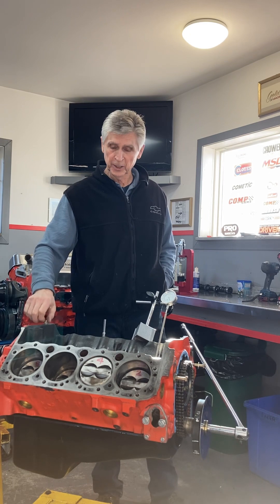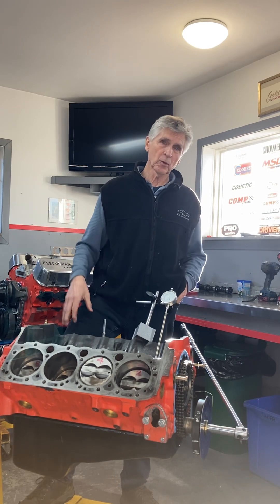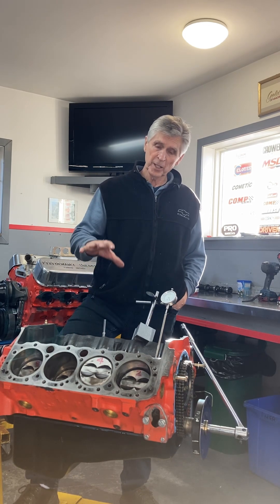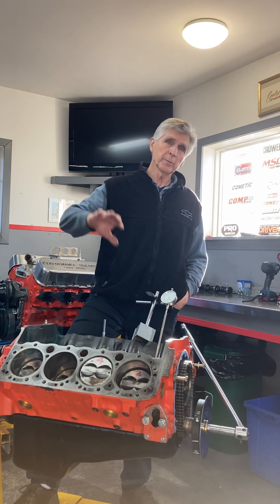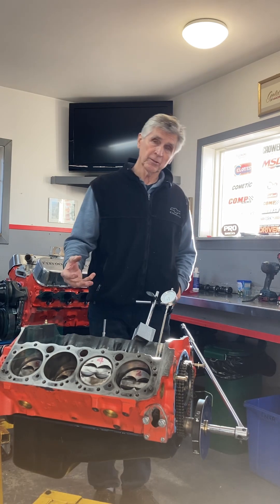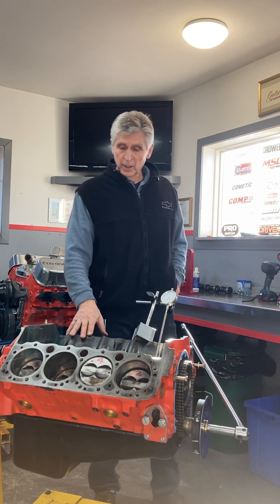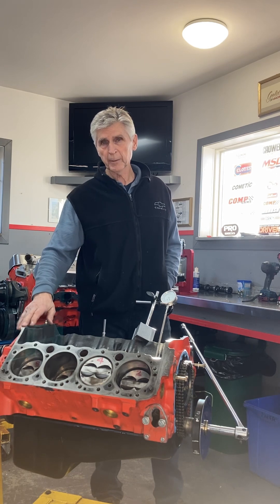It's not a big deal, but you have to pay attention to the details. The only bad thing about a roller cam is that it costs a lot of money — the roller cam setup is more than three times the cost of a flat tappet cam and lifter set. On a street engine with a fairly small cam like this, it doesn't necessarily make more power, so there's not that performance incentive. The real reason you want to use one is for reliability and a long and happy life. My customer agreed to do that, so we're converting this engine to a roller cam.